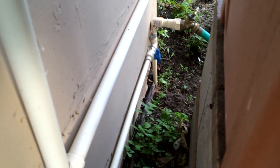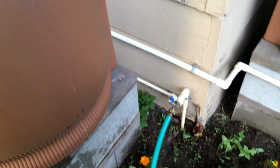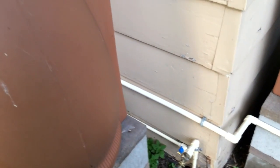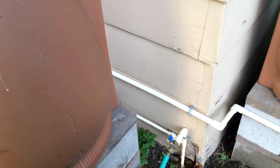Or with this system, if I go back to my garden rain barrel, I also have a pipe feeding into the three-quarter inch pipe going to the garden, and then it goes to a little ball valve with a blue handle. The pipe coming up from the ground is coming from the house with city water pressure. I can open that valve very, very slightly and get plenty of water pressure through — I don't want to open it all the way and put full city water pressure through and blow out all these push-fit connections. But I can put just enough city water pressure in to blow any sediment out of the system and it's pretty much good to go again.